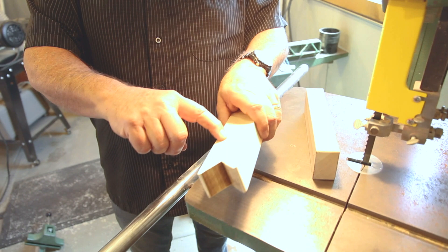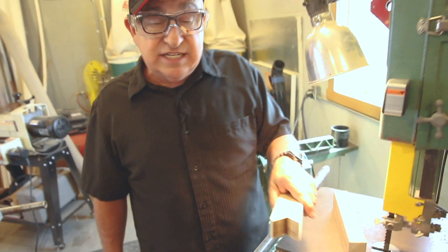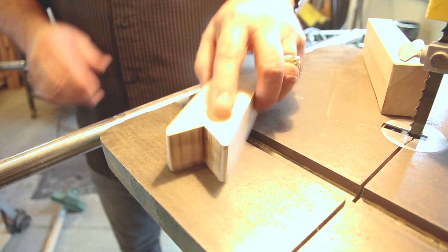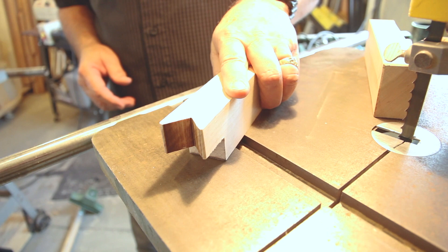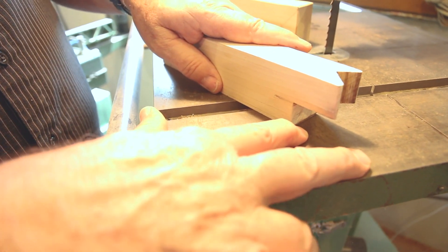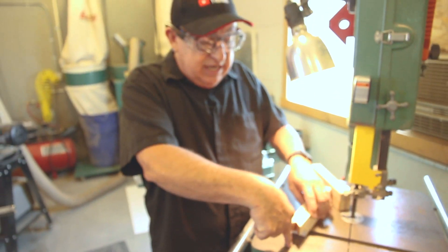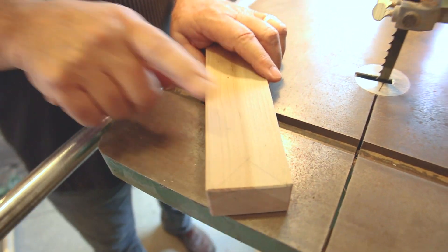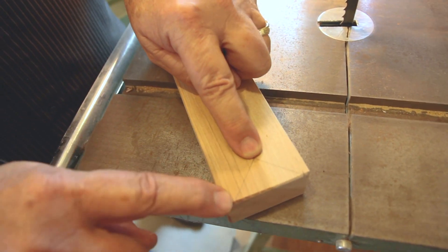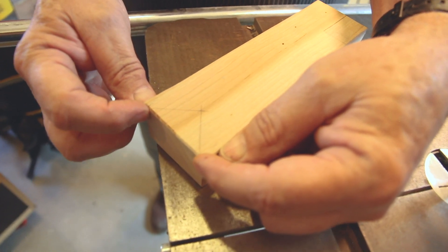This is about an inch and a quarter thick, maybe inch and a half, inch and three quarter wide, eight inches long. On this end, you have a V block which now allows you to put the drill bit straight up and down as your guide. And on this side, set up vertically, let's say you're using a Forstner bit and you've got the whole body of the Forstner bit and you've already set the drill with its center spur directly where you need it. Now you can bring this guide up to it and keep it perpendicular. I've laid out an intersecting 45, creating a 90 degree corner, starting in from the edges a little bit to leave a little more beef on the corners to make the tool more durable.